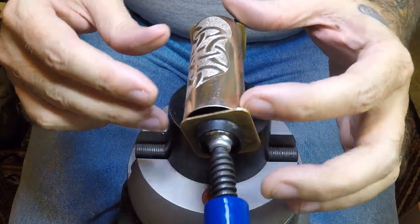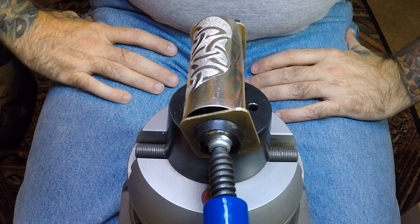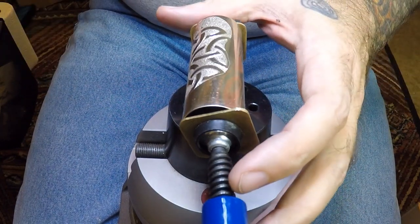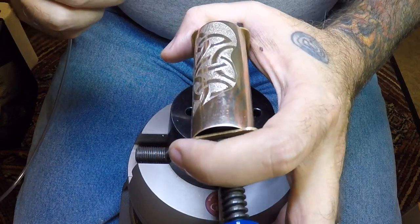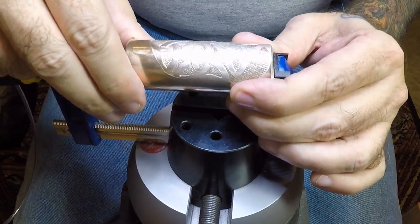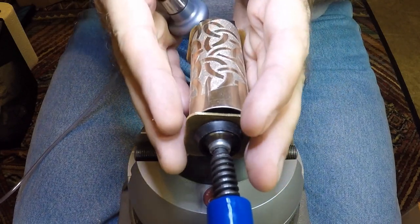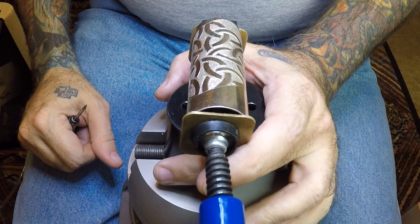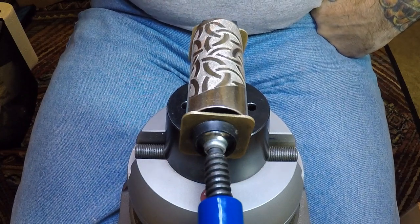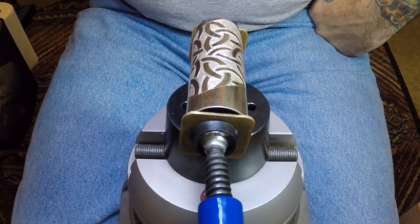The tube is set in a mod, and more often than not, it's friction fit. I'm sure that there are some modders who use a very minimal amount of glue to keep the tube in place. For the most part, though, mods are milled on a CNC, and the opening for the tube in the wood is designed such that the tube kind of friction fits into place. Now, if I have a mod in my vise, number one, I'm already endangering the wood of the mod because I have to crank down on the vise to get it done. I won't be responsible for breaking a beautiful higher end wooden mod because someone insisted that I engrave their tube while it's in the mod. That will not happen.